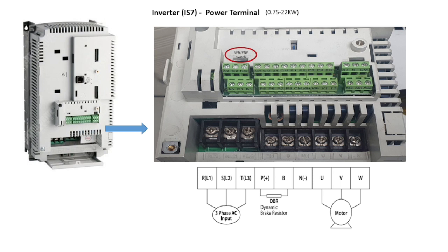Above the control IO board there is an NPN or PNP selection switch and one PTC selection switch. Above the S+ and S− control terminals there is a TR switch which is used to terminate the RS485 network connection. There is also an EMC filter switch — actually a jumper located inside a plastic cap — which is used to activate or deactivate the EMC filter.